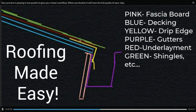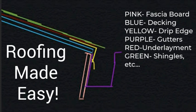Over the metal edge, you have the red, which is your felt or underlayment. Over the felt, you have your final roofing material of choice, whether you choose asphalt shingles, tile, metal roofing, or clay roofing. It pretty much is all the same concept here. As long as it is installed in this order, you should be worry-free of any roof problems, roof leaks, or water damage to your fascia board.